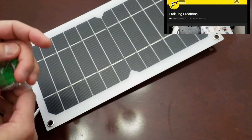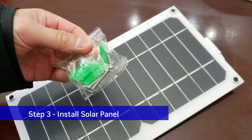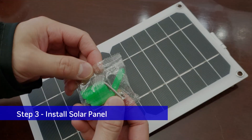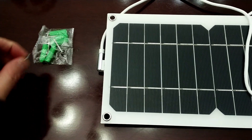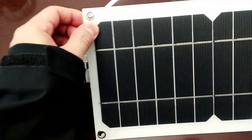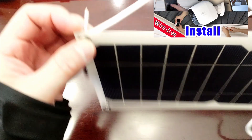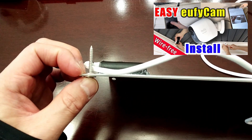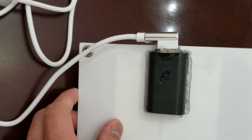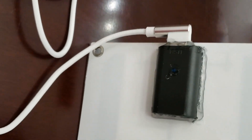Like what you see? Support us by hitting the subscribe button to get us to 2,000 subscribers sooner! Step 3: Install solar panel. The great thing about the EufyCam kit is that you get spare screws and anchors, and they work well for our solar panel. Install your solar panel as appropriate. Check out our wire-free camera install video for more tips on drilling and installation. When installing, be careful not to break the silicone seal you added for waterproofing the solar panel.